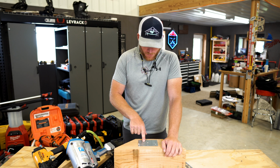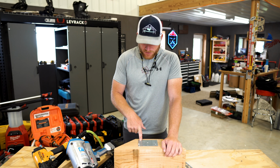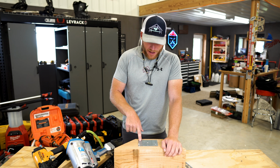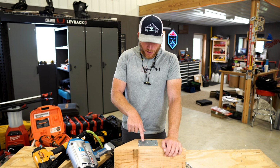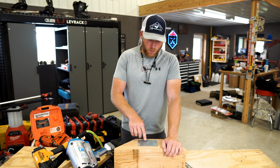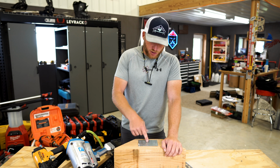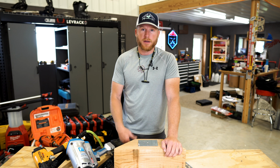Now, you might be saying, oh, but Kyle, that Bostich set those way better than that Fasco did. And I would say, yeah, you're right, but I don't think a code official is gonna like this. So I've got that pressure turned way too high. You don't want to destroy the integrity of that fastener. And the Fasco always sets it like a perfect depth almost every time, in my opinion.